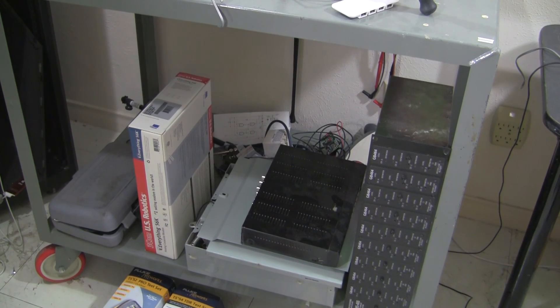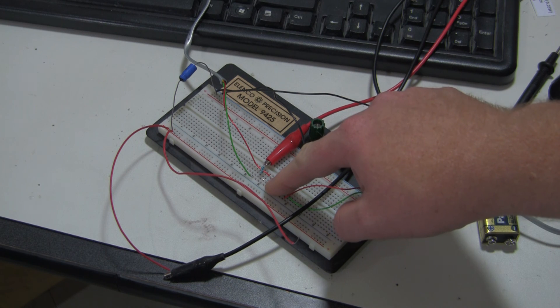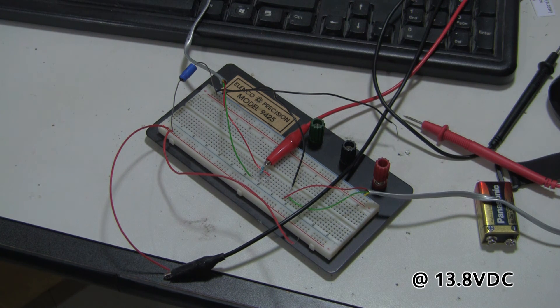Let's take a look at that line simulator. You can probably hear the thunder in the background - we're having storms here in North Texas and expecting some tornadoes. This is the line simulator I was working on. Basically what I've been doing is trying to connect two modems directly without a phone line - what would be called a leased line or dedicated line. I'm generating voltage out of my DC power supply with a 1 microfarad cap and a 380 ohm resistor, which drops it down to about 20 milliamps and allows me to communicate directly from one modem to the other via two terminals.